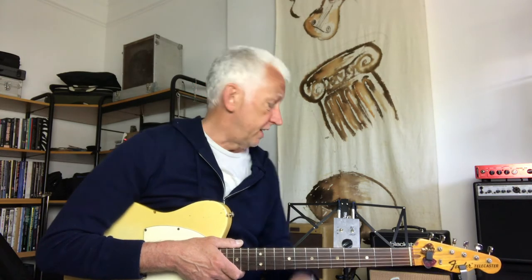This is a wire wound resistor, so if you listen carefully, the sound is actually going up as the wiper crosses the resistor wires. It's actually dip, dip, dip, dip, dip. It's not continuous like a carbon track. Now that is a pretty good kind of rehearsal practice volume. It's got a bit of meat in it, but I'm talking over it now. That's about how loud it is, and I'm not raising my voice.